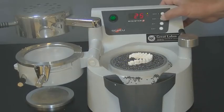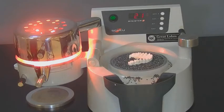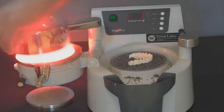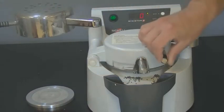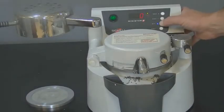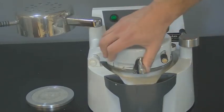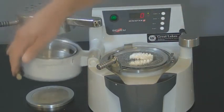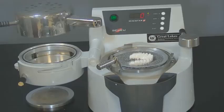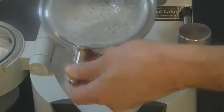Enter the heating time of 25 seconds into the MiniStar or BioStar and swing the heating element over the pressure chamber to initiate the heating cycle. Once the heating cycle is complete, remove the heating element and swing the chamber over the model. Lock the chamber in place by turning the locking handle toward the front of the machine to activate the pressure and the cooling cycle. At the end of the cooling phase, evacuate the air pressure from the chamber and unlock the chamber by turning the locking handle toward the back of the machine. Slide the clamping frame to the left to release the material and swing the chamber back to its open position.